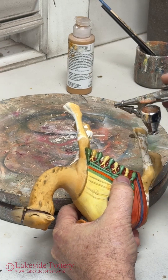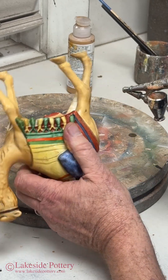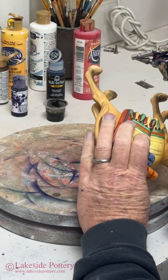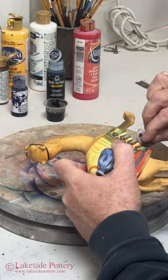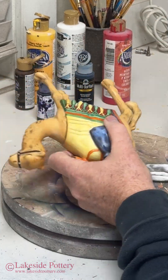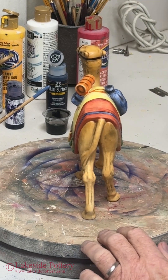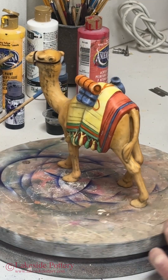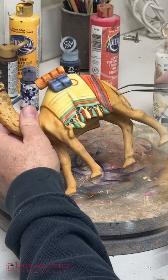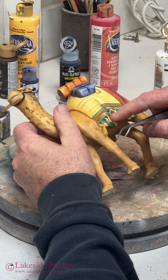I use an airbrush to match the colors. I start with the base color. We have a whole tutorial about painting, so this is an abbreviated version — there are more steps there. This next part is how we create the dark spots that you see on the neck: we apply paint after we've glazed it once, then rub it off and leave some leftover black to show the spots and stains to make it look organic. Then the last step of painting is to get the right tint — a little more ochre is needed, translucent ochre. What I'm doing here is removing the latex, which I applied earlier to protect high-value surfaces so I won't paint them where I don't need to.